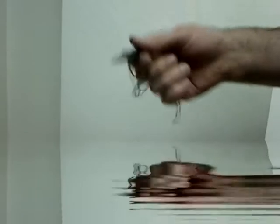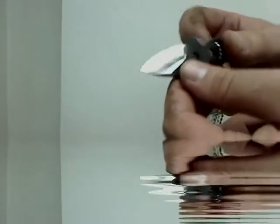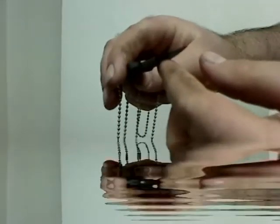The cKc Pendant is a 4mm thick O1 tool steel blade hardened to 58 RC. The blade is ground only on one side as a chisel grind, and it's a heavy convex grind.